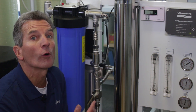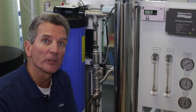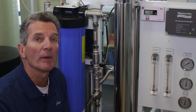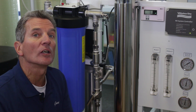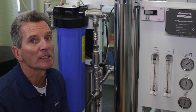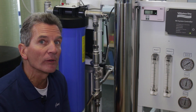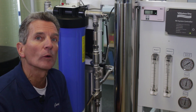That's important because you can see the performance of the system. I suggest folks set up a chart and monitor this on a daily basis. When you start to see the mineral content of the outgoing water creep up, that tells you that you're going to need to replace the membranes sometime relatively soon — probably years down the road — but you need to know when that happens to maintain your water quality.